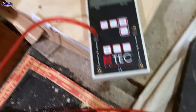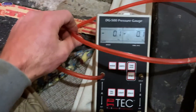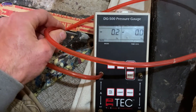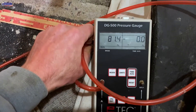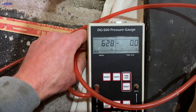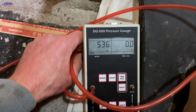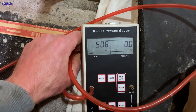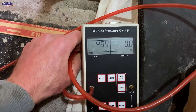When I put the cork — the stopper — in the hole here, watch what happens to my micromanometer. So it's out now. Now as I push it in, that number goes really positive, and we'll see it slowly start to go back towards zero. That's a good indication that you have a dead hole.